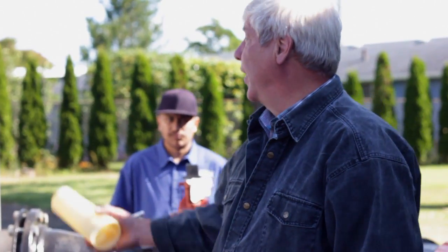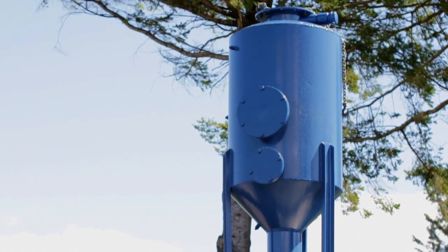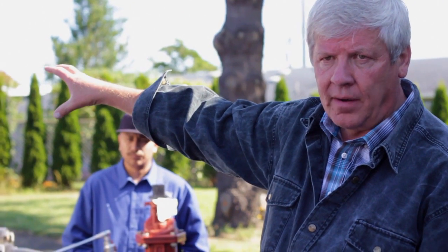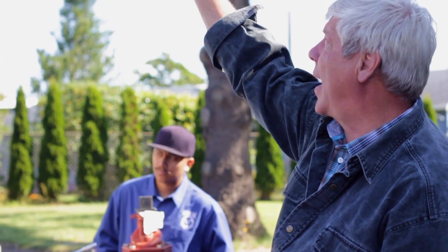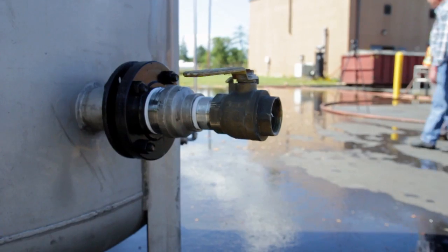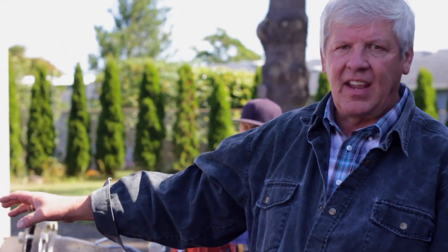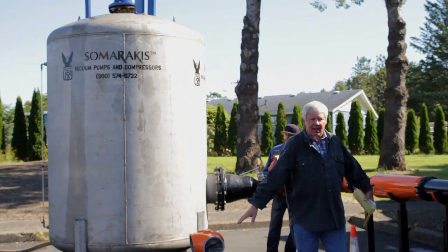What we're going to do today is fill this tank — the reservoir holds 1,140 gallons of water, and the top tank is about 186 gallons. We have a choke between the top tank and the main reservoir that is a 96% choke. When filled, the water comes splashing over the top to confirm 1,140 gallons. There's a sight gauge on the left hand side of the tank. We're going to time how long it takes to empty strictly with gravity and barometric pressure — it should be 95 to 98 seconds, giving us somewhere around 12 to 14 gallons per second.